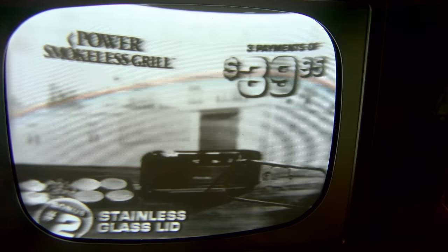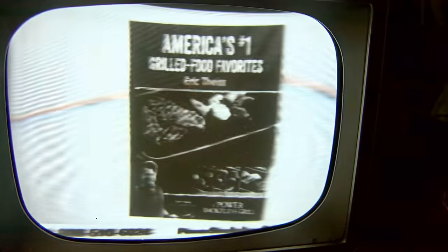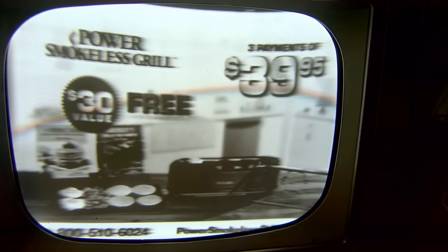You know, it really doesn't even exhibit a lot of the problems of bad capacitors. The vertical deflection's not that far off. It's rock solid. The picture's a little soft. I would think it could be a little bit sharper, something. That's adjusting the fine tuning.